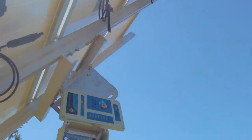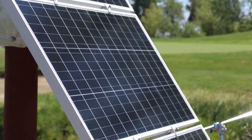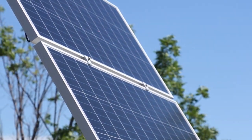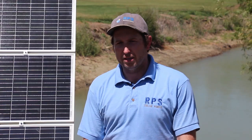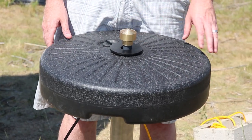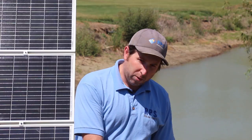We have our solar panels installed using our top-of-pole tilt mount. This mount is great because it allows us to change the angle of the panel by loosening only four bolts — we can adjust it for winter, summer, or maintain a year-round average angle to produce the most fountain water for your pond. We have our pump and float assembled with our fountain head on top — this is the cluster head. We have a rope and a cinder block attached. We're going to install this out in the pond. We're about two feet low right now, so we're leaving two feet of extra slack in our rope to account for seasonal water level variations.